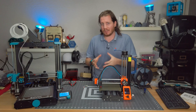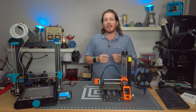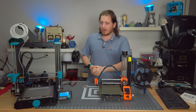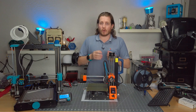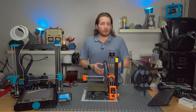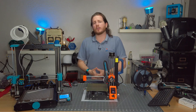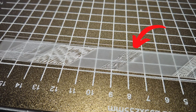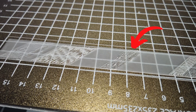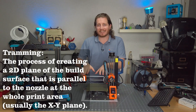When we look at Z Offset — and we're running a Z Offset test right now on the Prusa Mini — it comes down to the amount of squish. Let's assume your bed is level and perpendicular to your nozzle. If for some reason it is higher on one side than the other, you will notice this in your first layer. If on one part of your build plate the lines aren't even touching each other, and in other areas the lines are disappearing into the bed itself, you don't have an actual trammed bed with your X and Z axis.